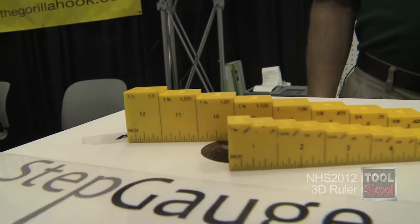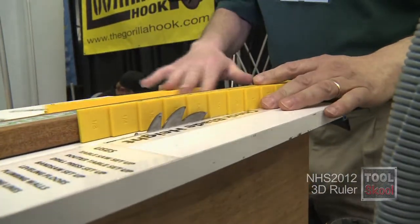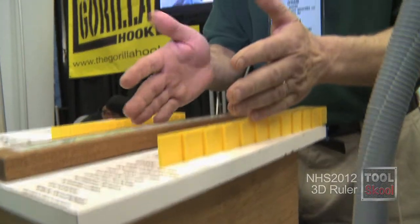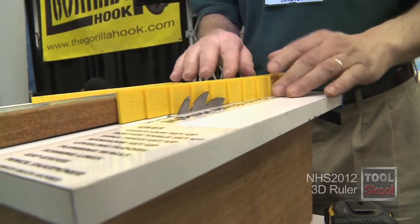I've got a demonstration blade here. We can calculate blade height, I can calculate rip width. I don't have to worry about my fence cursor, how accurate that is. If I've just changed blades or I'm using a dado blade, I don't worry about my fence cursor. I've got precision right on my hands — I can go to a couple of thousandths of an inch.